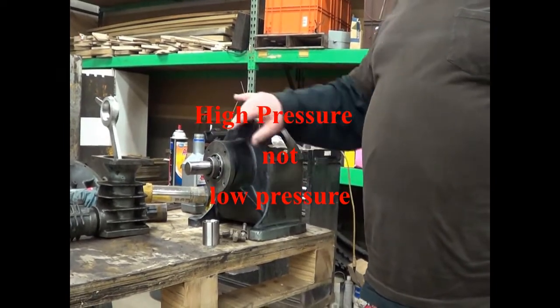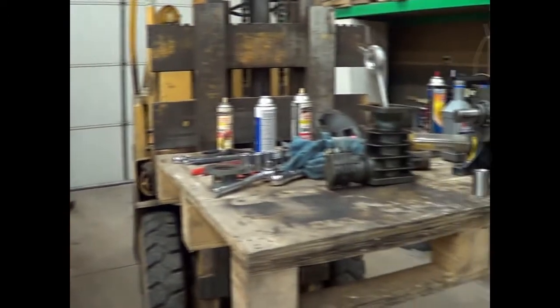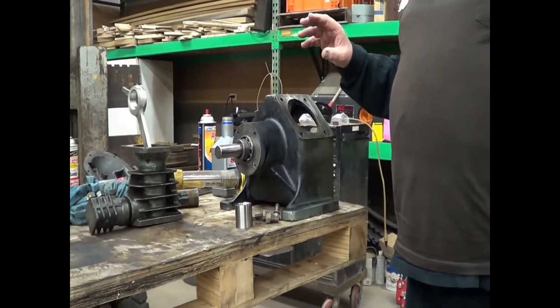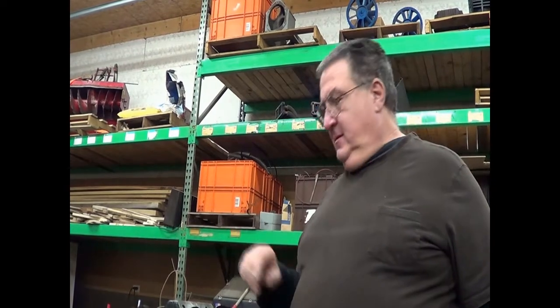Now, before I left last night, I painted a little bit of black around here, and I painted the intercoolers black because they would actually be kind of tough to paint when on a machine and get them nice and uniform looking. Caution, if you paint your intercoolers, you don't want to just pour the paint on. You just want to get it to black so it dissipates the heat better. You don't want more paint on there that may hold the temperature. This is just a color change to dissipate heat.